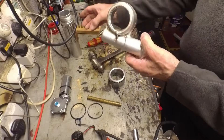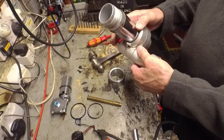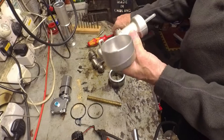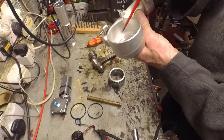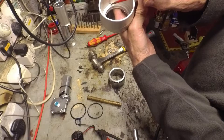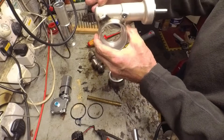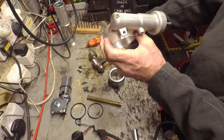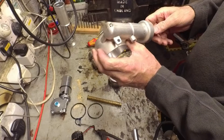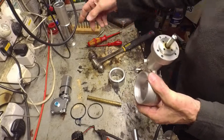All told, a whole lot of seals. And there is a small hole — if you can see that — the oil can get in from this side. The oil filling hole, I've already taken the plug out of there. It had a blue coloured oil in it, as opposed to the red oil that was in the main damper.